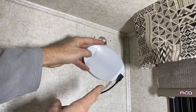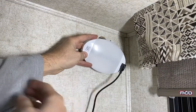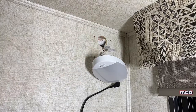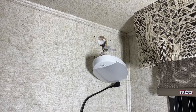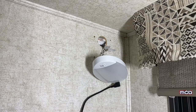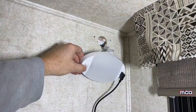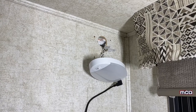The nice thing is you don't have to have the light on for it to charge — it can be charging with the light off, which is great. This is really what it's going to be used for — just charging a device, a tablet, a phone for those using the bunk. The bottom bunk bed area has a light as well, we're going to switch that out, and I'm also going to do one above the bunk over the cab. This is a 2019 Forest River Sunseeker Class C RV, and even though it's not a top-of-the-line one, there's very little 12-volt charging in the whole thing. This can sleep up to 10 people and there are very few charging ports, so this is a great solution. It's pretty affordable and under $20 per light.